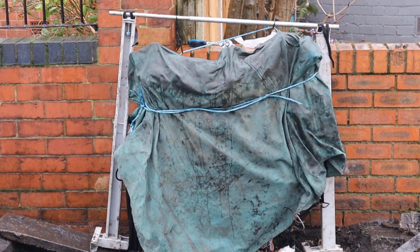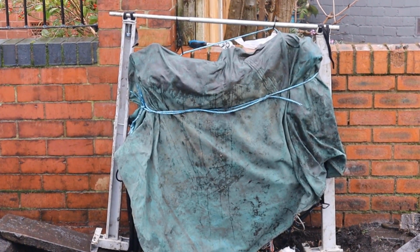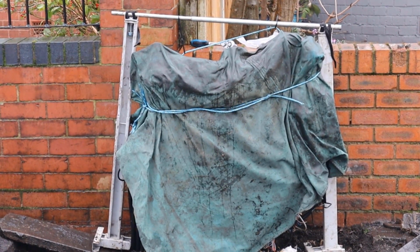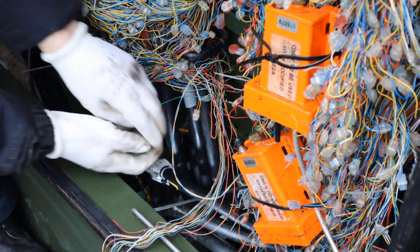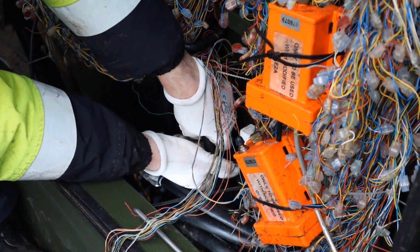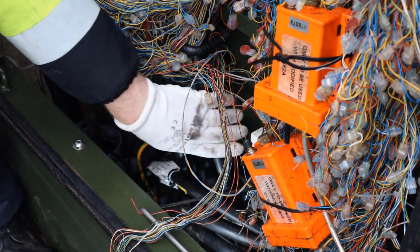Here you can see the existing shell has been removed and the assemblies are supported using the PCP connection support frame. We can now see why protecting the connections was so critical. With the new shell in place, now pull sufficient cable from the joint box in order to rehang the assemblies. Repeat the process for all cables required.